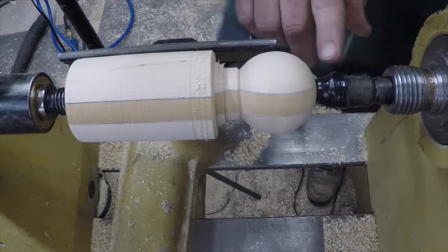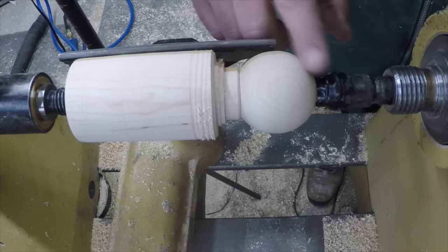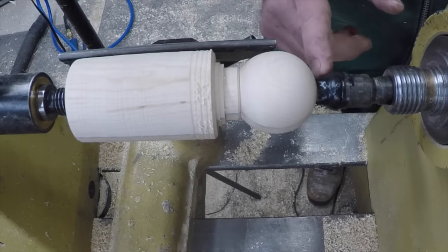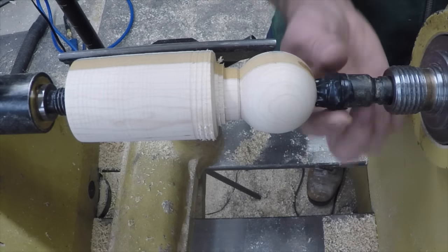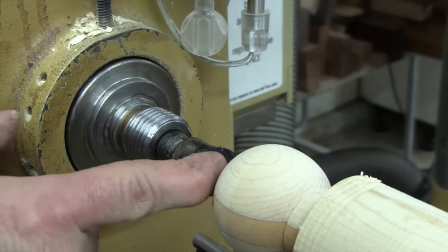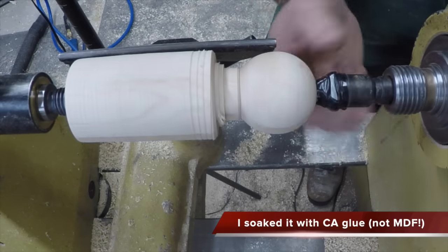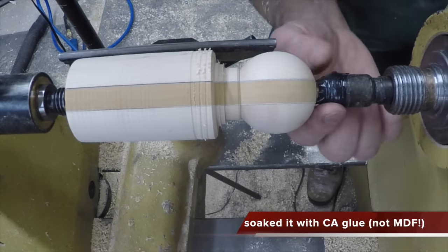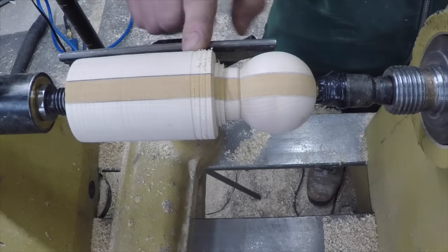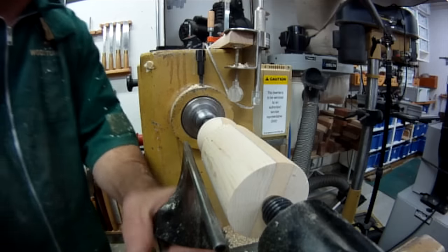So I've removed the shadow jig since I finished making the sphere part of the bowl of the spoon, and then I noticed that my MDF was starting to split at this end, and so I probably shouldn't have quite finished. I should have left a little bit of maple there until the very end, but I've soaked it with some glue and I've wrapped it up with some tape, and hopefully it holds. I'm just going to have to be a little bit gentle removing this material over here, which I have quite a bit to do, so I'm going to have to take my time